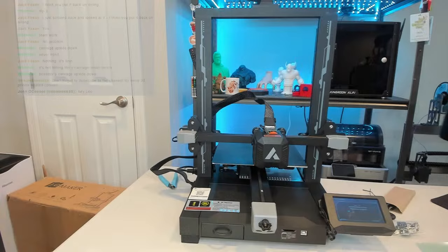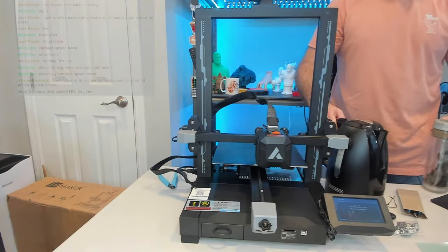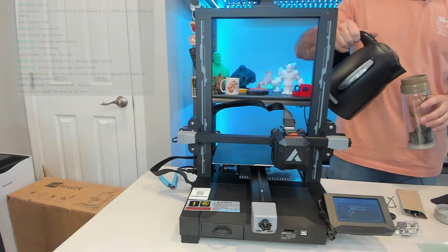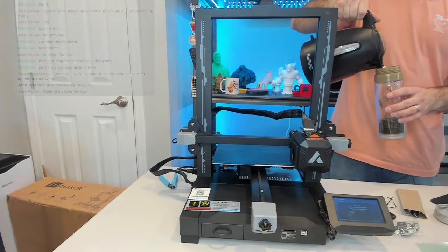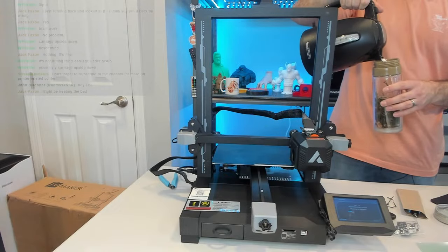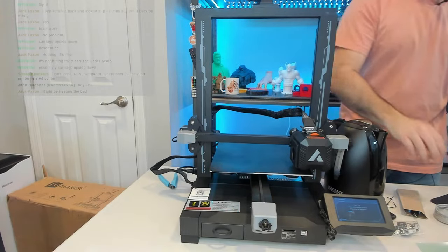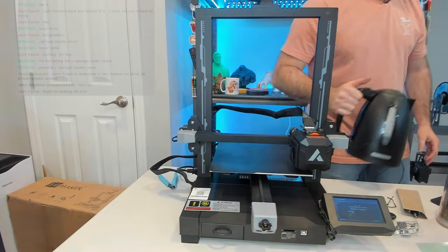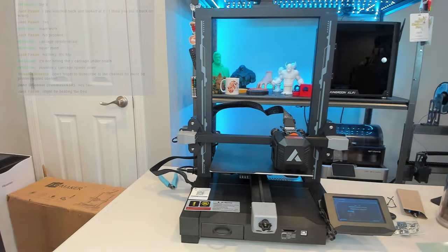We just put the JG Maker R1 together. Went together very quickly. Y end stop was broken. The lever on the end stop wasn't there. We had to do some surgery on an old end stop and then put it back on correctly. Thanks to Jack, who was eagle-eyed with that. That being said, I still don't think it's in the right position. We might have to fix it down the line. Other than that, it went together quickly.